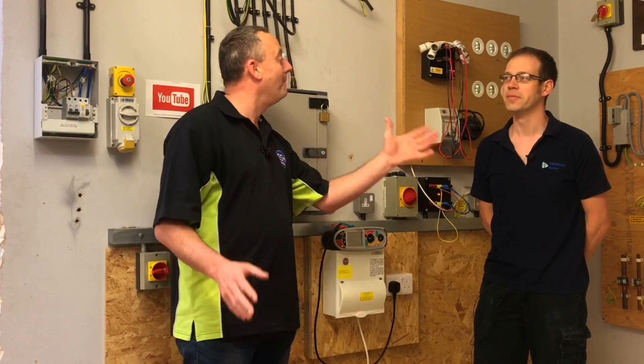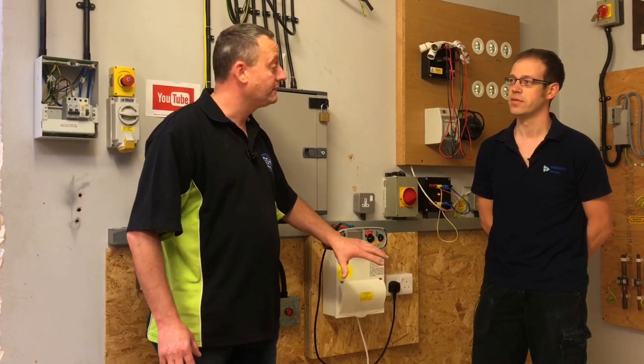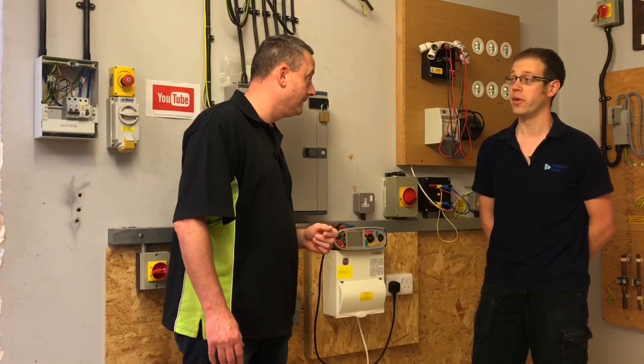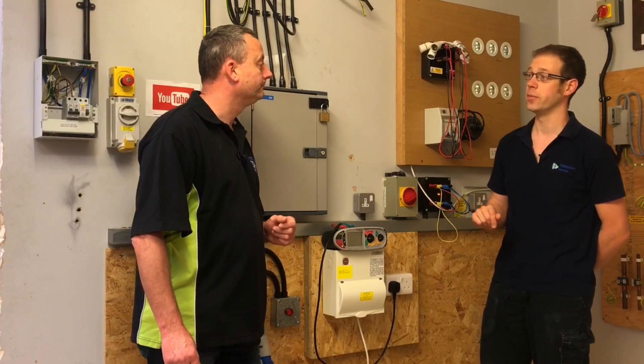So wait for it, folks - that's going to be the case. There'll be messages and comments below. Start flexing your fingers for the keyboard. So at the point of recording this video, we're going with the following as our best practice. That's an A-Type RCBO, and for me that means we're going to do 10 tests when testing it as an RCD, whereas up until now, testing AC-Type RCDs, we've got very used to doing five tests.